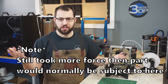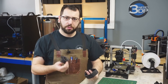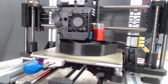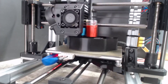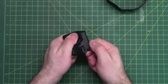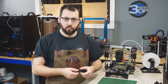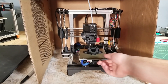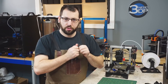It's not a scientific test — you'll just have to believe me that this one broke quite easily. The next one I printed was the same model, same slicer settings, only I added a brim and a draft shield. With the brim and draft shield, it successfully held to the bed and the draft shield allowed it to have slightly better layer adhesion because it kept more heat next to the print itself. It still broke easier than the fully enclosed print, however it didn't break as easily as the unenclosed one. And lastly, I put the cardboard box enclosure on the printer and printed one with just a brim. This one had the strongest layer adhesion and giving it the same amount of force that broke the other two, it's still holding together.